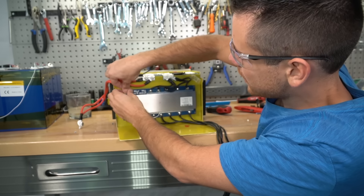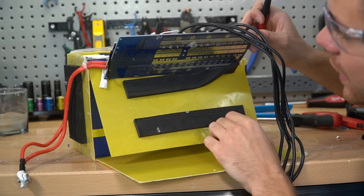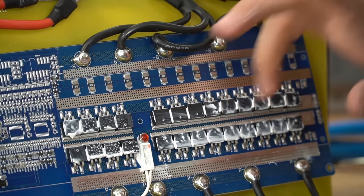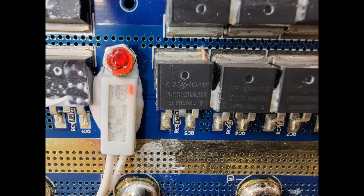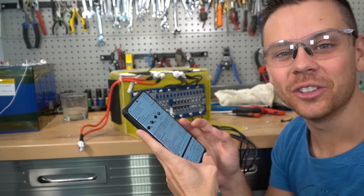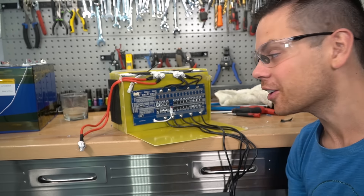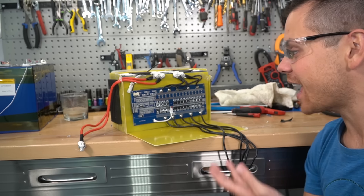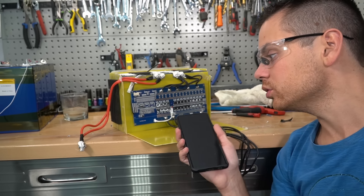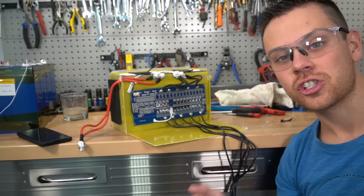I cannot seem to get this battery out — there we go! We've got a 100 amp BMS and these solder joints look pretty good. Even though there's five conductors going into this lug, it actually looks pretty good, though I really wish they found another way to do this. We have silicone on the balance lead and the main terminals for added protection. At the bottom, we have two leads going to a temperature sensor, but this is only for high temperature protection and they're connected to the parallel bank cells. The BMS is not touching the cells — there is a piece of fiberboard between the two. These cells must be half-decent if they're pulling full capacity on the first cycle. One question I have is whether this BMS can handle having these batteries in series up to 48 volts, and how we find out is by looking at the voltage rating of the FETs.